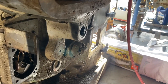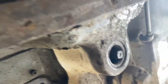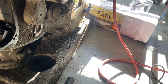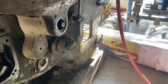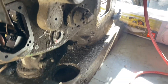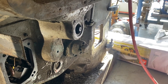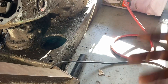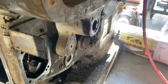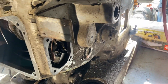I'm on the other side of the mill. Here's what the other side of the table looks like — you can see the rod way back in there. And here's the provision for the hand crank. I put this crank on there — this is from my shaper — and I can turn it and turn the table. So I think what I'm going to do, the very easiest thing, is put a coupler on this, weld a pulley on it, put a motor down there with a V-drive. There's already a plate I can hook the V-drive to. I'll broach out a square in the coupler, get it secured on there, and put a one horse or one and a half horse motor — whatever I've got laying around. Nice and simple, effective, and completely removable. Won't have to do anything with the stuff on the other side.